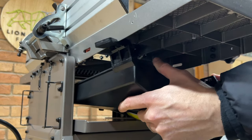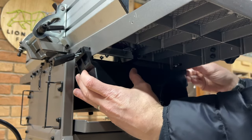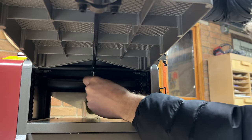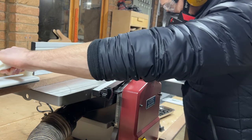When you want to put it into planer mode you'll first need to remove the dust hood and drop the thicknesser bed all the way down so that you can insert the dust hood the other way around, making sure you're locking the tabs on the side again. Then you'll find the hole to screw the alignment screw in from underneath, which lines it all up again. Get your fence all straightened up and locked in place and you're good to go with some planing or jointing.